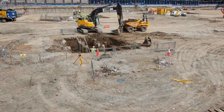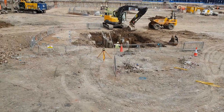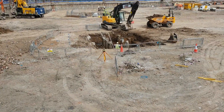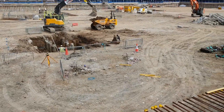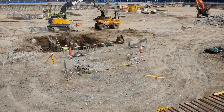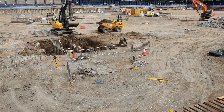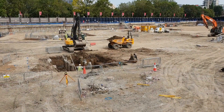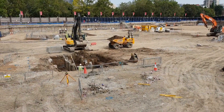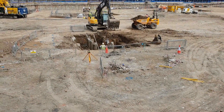This is how we're going to be starting the pile caps. You can see my lines here — this is the actual line for the pile cap itself. What I always do is mark the offset line as well, on the other side — a two metre offset. You're going to lose that line because as we dig it steps out. The dig itself is going to be bigger. This is actually a crane base but all pile caps are the same story. You can see the laser — setting the laser is the first thing we do.